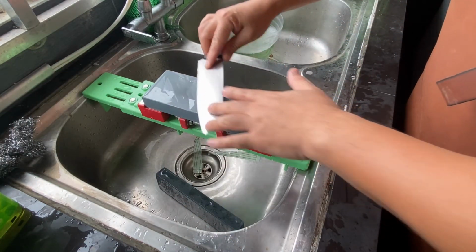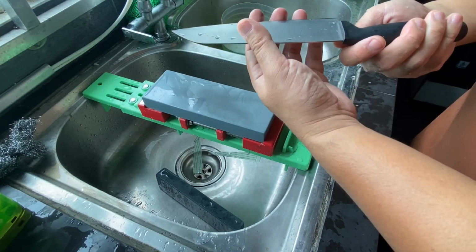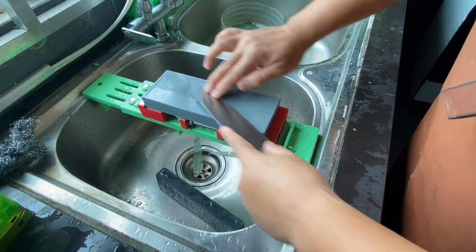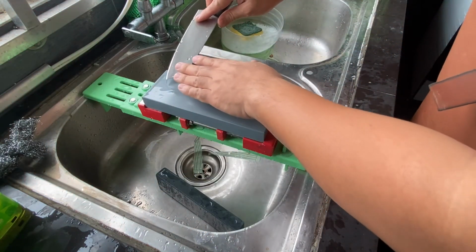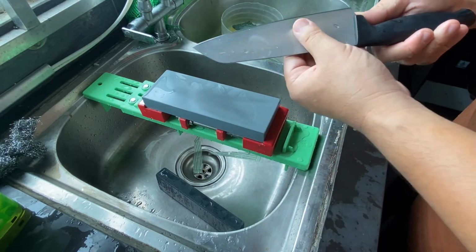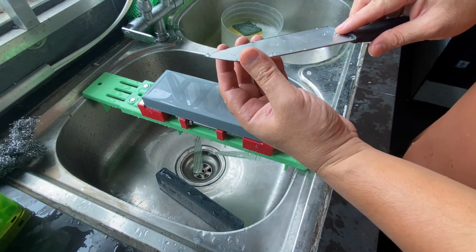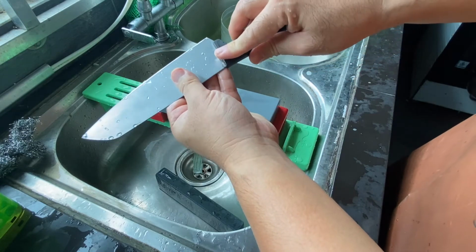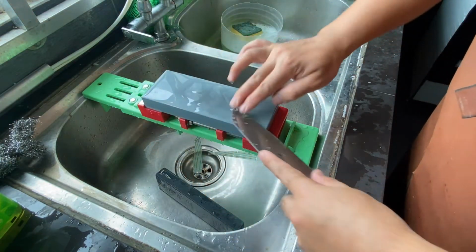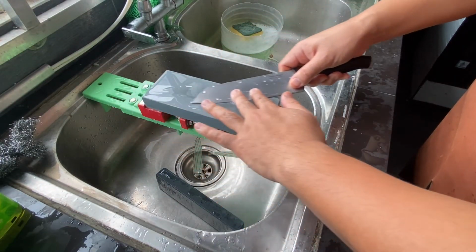It produces a lot of swarf also, and I love that stone because that's the reason I like it. It can knock off burr during sharpening and leave you with a nice finish. But this one is good also. Compared to King Neo, this is harder, so if you are new to sharpening, this is your best to try on, because it's no dishing, you have a lot of stone to practice on. And it leaves quite a good shiny edge. I'm still doing minimization pass because I can feel some burr slip side.